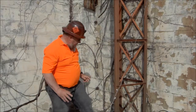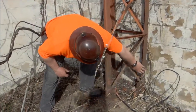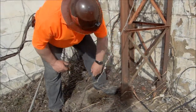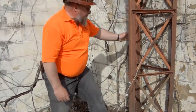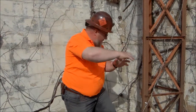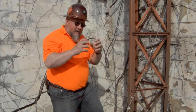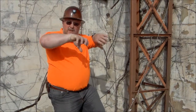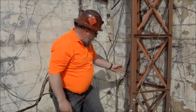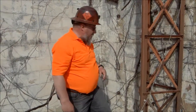We're going to cut these two. I'll probably take more on the front side — cut a single cut out here — and then this back one, as the tower goes over, should bend. Angle iron has got a lot less strength when you bend it down rather than bend it out. We're going to use this back and have that as a hinge point.